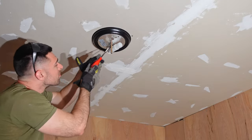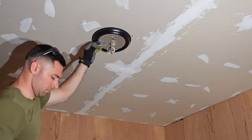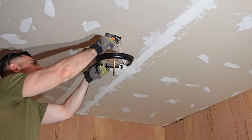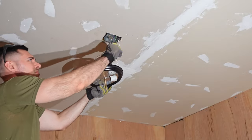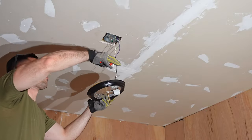Okay, first thing I'm going to remove the old boob-style lights from the ceiling. I've already turned the power off, so I'll remove the glass cover, then remove the light bulb first because it may be in the way when accessing the screw — which it was for me. Take the screws out, rotate the base and it will drop down, then simply undo your wiring.